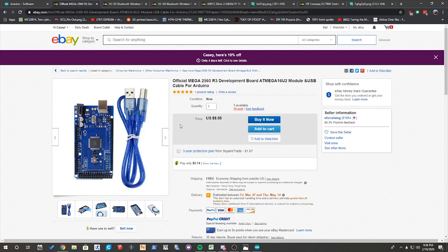It'll be really useful if you have some extra Arduino Megas on hand, just because you're going to be soldering wires directly to the back of the Arduino depending on how you decide to wire up the Bluetooth module. Having a few of these on hand will make it extremely easy in case you ever fry one accidentally or in case you just want to have other projects. You'll also want an extra Arduino in case you want to keep one on hand for reprogramming Bluetooth modules. But they're technically not required, because you could use the Arduino that's already in your Speeduino ECU if you're not afraid of messing it up or if you trust your soldering that well.